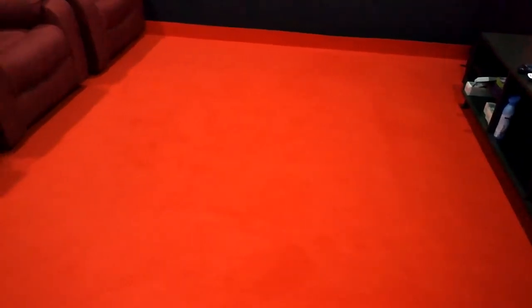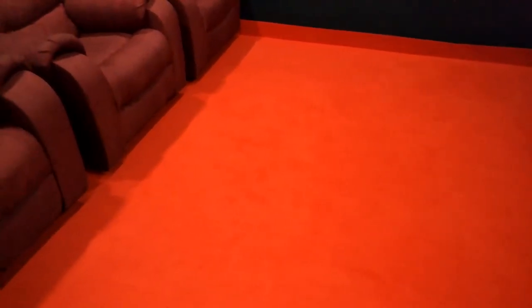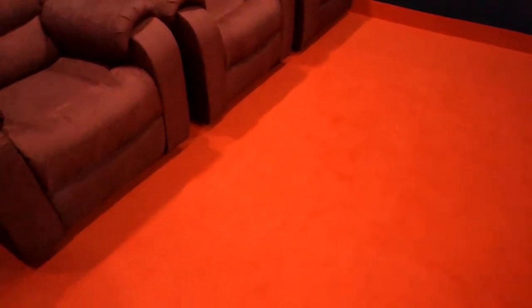For the floor, carpet is used. These are 8mm profiling with 5mm carpet, so you would probably end up with a 12mm thick ground, which will give you a much better cushioning effect when you walk. Also, from an acoustics perspective, a cloth based floor, or even wood, would give you a much better acoustics effect.